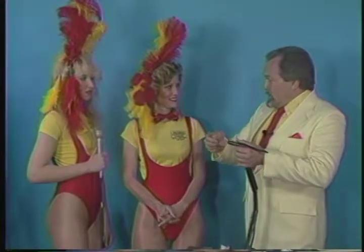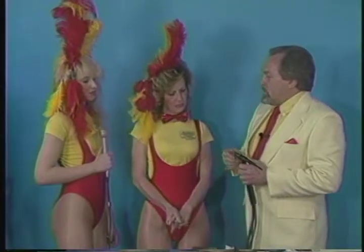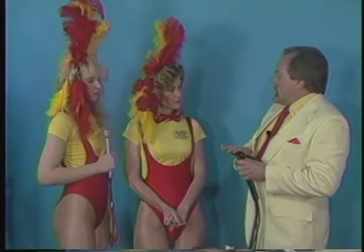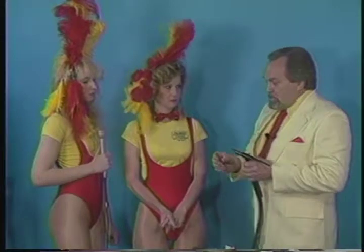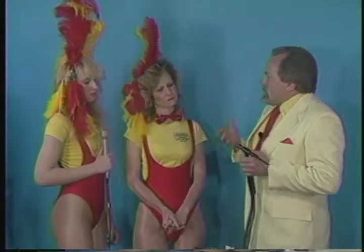I bought one of the little rinky-dink outfits. The problem is it doesn't have a way of turning the gas on and off just when you're welding, and you can lose a $50 tank by forgetting, just like that. You'd be amazed how quick it'll seep right out. And it doesn't have a water-cooled torch and a water cooling system. So maybe you can only weld for half an inch or an inch, and your torch is overheating. So it really is Mickey Mouse.